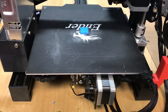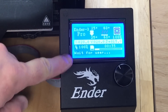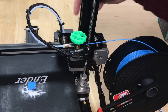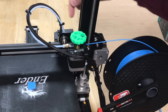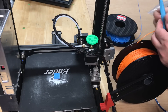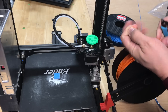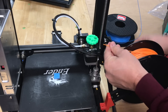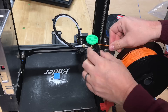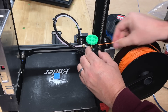It moves to that 20-20 position and there's the first section, 25 layers high. You can see it's telling me it's waiting for the user — I could take forever. The nozzle can be cold but because I retracted that filament way up, I can still pull it out. It's not stuck in the hot end. I load up the new filament while this thing is still waiting, feeding it into the extruder, through the Bowden tube, all the way down to the nozzle.